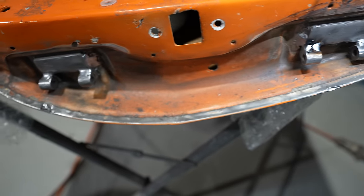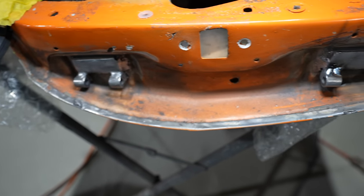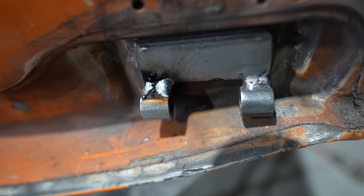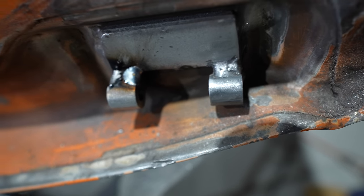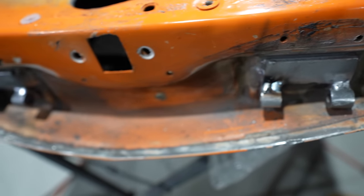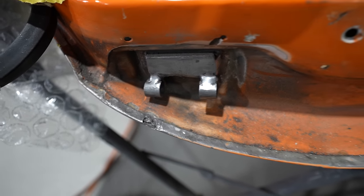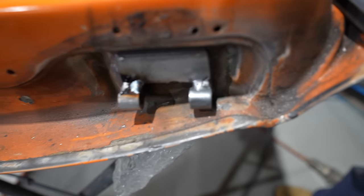They were worn. So what he's had to do is take those hinge plates completely off the door, because those barrels are welded top and bottom. And to weld them back on, if you remove them, you've got to get in underneath that barrel, and you cannot do it on the door. So that's why he's had to remove the plates to fit up the barrels again to get in under. He's had to pre-weld those barrels on before he's fitted those hinges back onto that door. But now that he's done that, they're all back on.